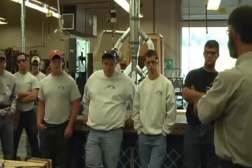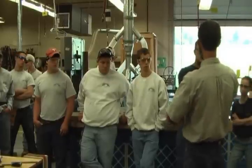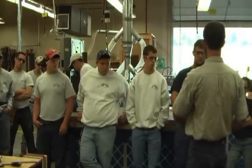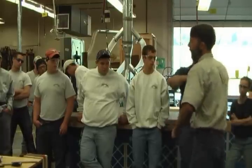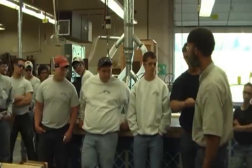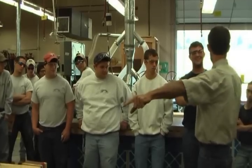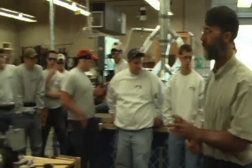Tight grip. Right? Hold on to that for me, leave the middle of it. Yeah, hold that and that. I'm talking about a tight grip. I do this. You shouldn't get it away. Or I shouldn't get it away. That's the kind of firm grip you want to have when you're grinding, when you're dressing. Thank you. Good job. Alright?